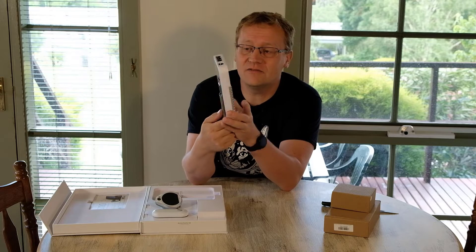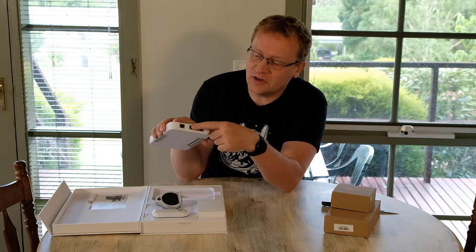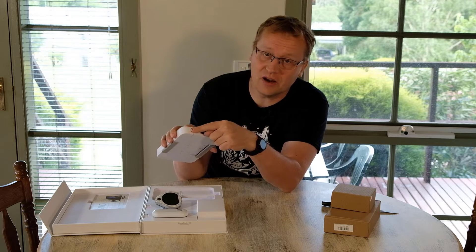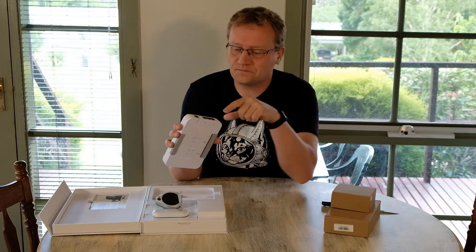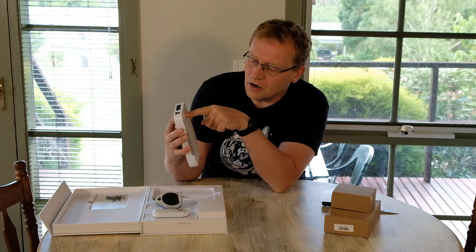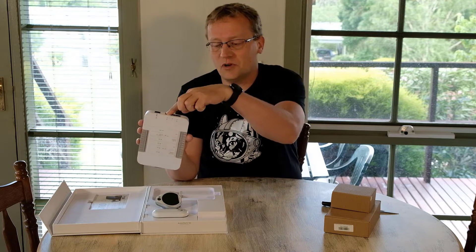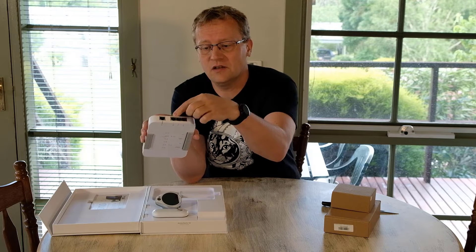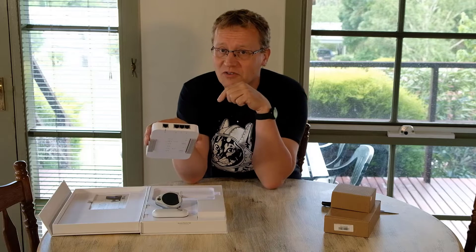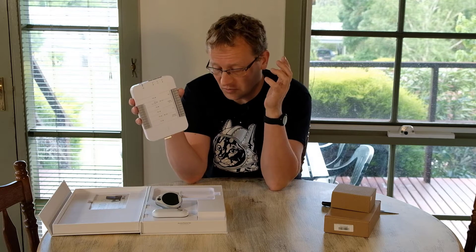At the top of the hub you can see there are three LAN ports and then power — PoE, power over Ethernet — which is kind of cool. I can power it with the switch right there. There's a port for the basic access reader and a port for the pro unit, and you can also plug a camera into it so you can see who's at the door.